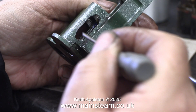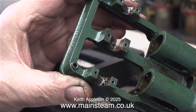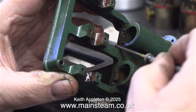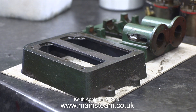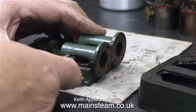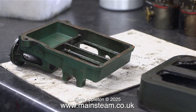In this clip I'm having a look at the main casting. Although it's very well machined, I just don't understand why all the casting sprues were left in position — it looks really bad, really rough and very amateur. The castings are left rough at the bottom and all you need for this job is a file. Even the bed casting isn't cleaned up; the two slots on top are very rough around the edges. These parts are going to be the most difficult to clean up. I'll show how I clean up these slots in the next episode, but that's it for now.